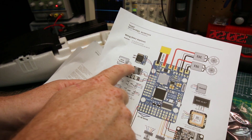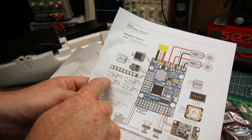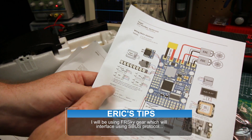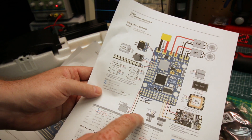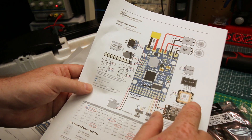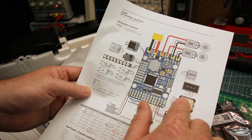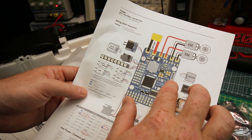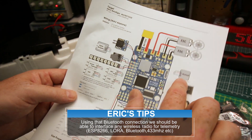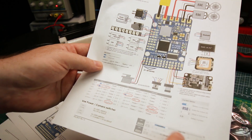Digital airspeed would go to serial data and serial clock — that's I-squared-C. Our different receiver layouts would go here depending on which one you have. It gives you your terminal numbers — like if it's Crossfire or SBUS — and how to lay it out. All of our servos are here, our two cameras are down at the bottom. Our video transmitter goes here. Our GPS goes to TX3-RX3. An OLED, which I'm going to use, is going to go on serial data, serial clock. Absolutely wonderful — they lay everything out great. Bluetooth connection — if you wanted to hook an HC-05 Bluetooth module, no problem. And then all of our layouts in iNav here.